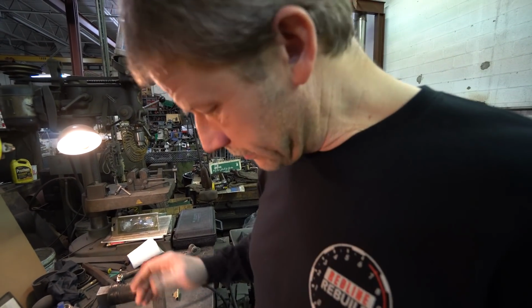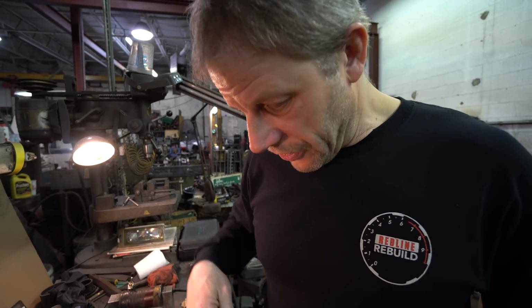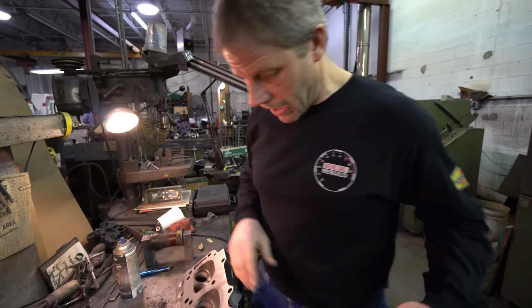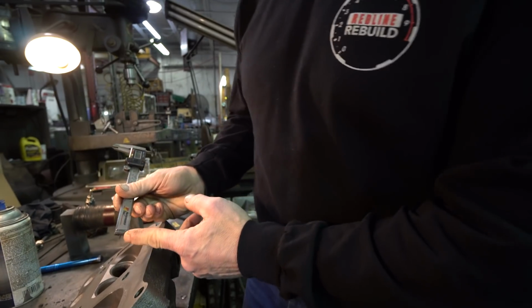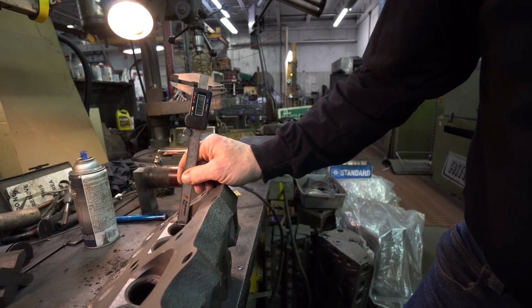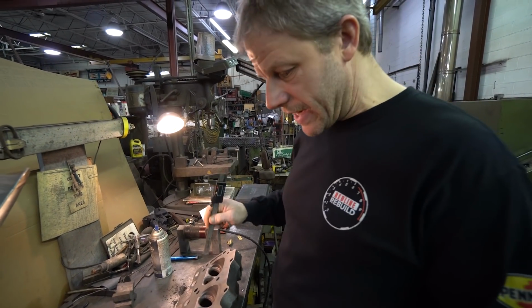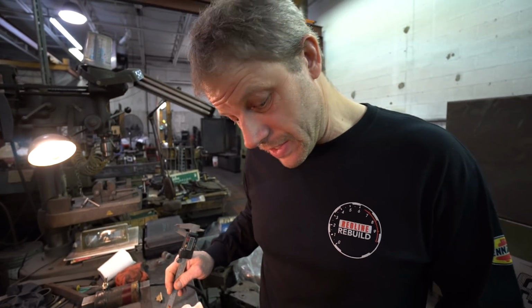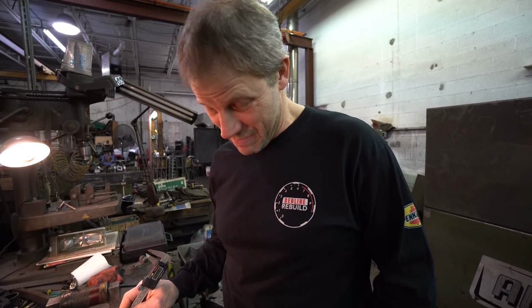All right, so I'm not sure how optimistic I am on the seat replacement. The thin seats are roughly 217 thick, which means we've got to put a 217 counter bore in. So this is 217 from here to this end. You're going to come in and cut a counter bore to push the seat down in there, which is all fine and dandy, but you still have to have meat on the backside to hold the seat. I don't know, we'll see what Mark says, but I don't think there's enough there, but he's the guy that does cylinder heads and not me.